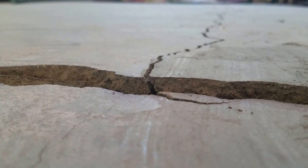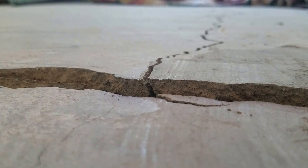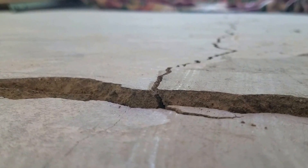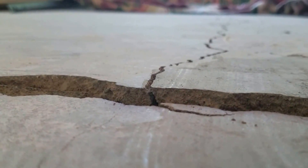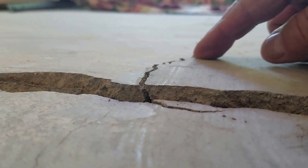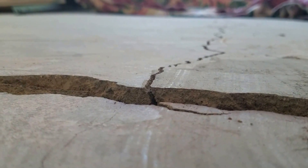Hello folks, thanks for stopping by ConcreteRepairman.com. What you're viewing is a heave fracture on an interior floor in a bedroom. This is a keyway joint right here running that direction, and this is a separate crack, so we consider this a triangulated fracture.